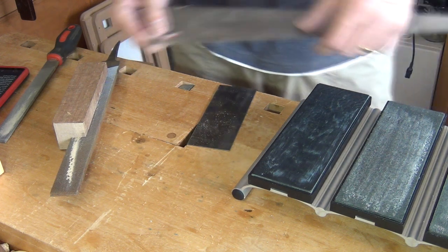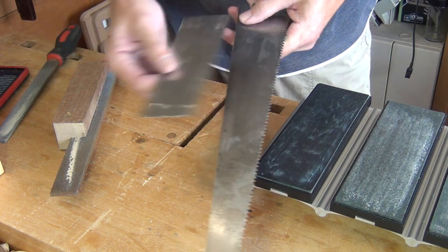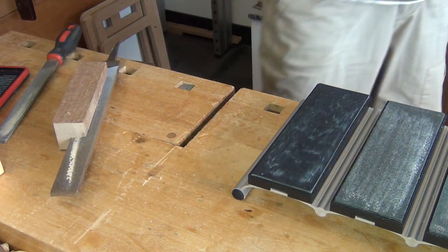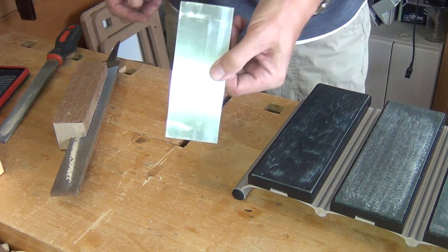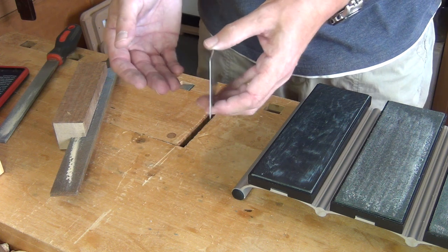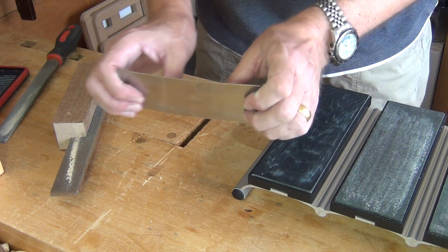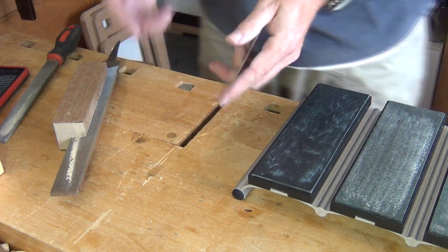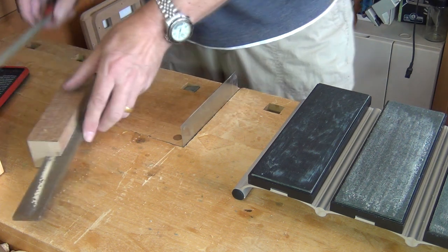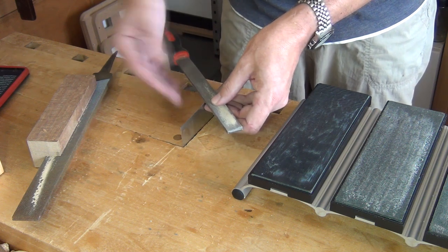How do we prepare a scraper in the first place? If you don't have one and want to make one, you can use an old saw blade — just snip out a piece, anything from about four to six inches long by about two to three inches wide. Once you've got your blank, or if you've purchased a new scraper, it's important to make sure the edges are at 90 degrees to the faces — at least if you want to get a burr on both sides. You can use a scraper in one direction, then flip it round and use the burr on the other side as well, which gets you twice as much out of a single sharpening. To prepare it at 90 degrees, you want a file. You can stick the card in a vise and work the file along the edge, using your fingers to make sure you keep the file at 90 degrees.